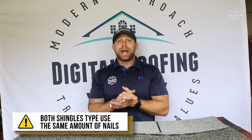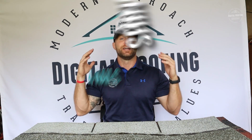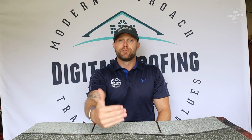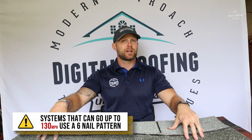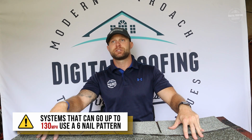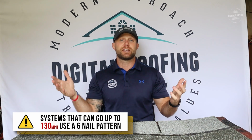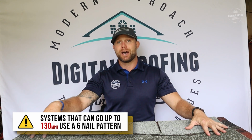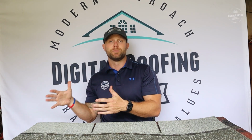And so the minimum number actually for every single shingle manufacturer in America is 4 nails per shingle. Now for most systems, you're going to need 4 nails per shingle. And then also if it's a system that can go up to 130 miles per hour, particularly in some areas like Florida, Oklahoma, places that have a lot of tornadoes and hurricanes, there's actually a 6-nail pattern that you can put in that is going to make your shingles a little bit more secure to your roof.